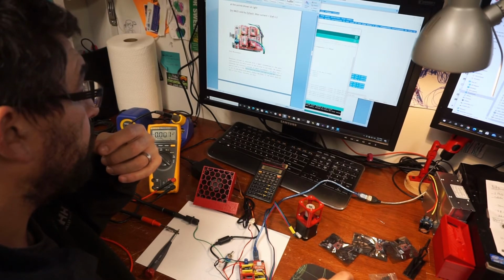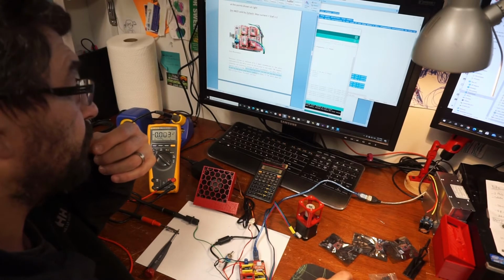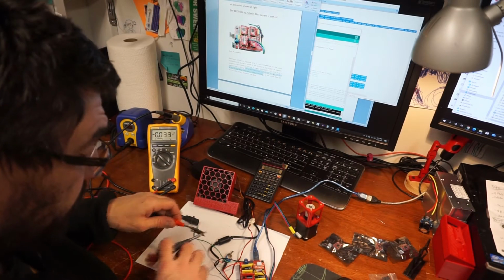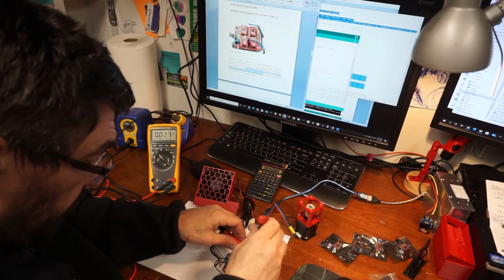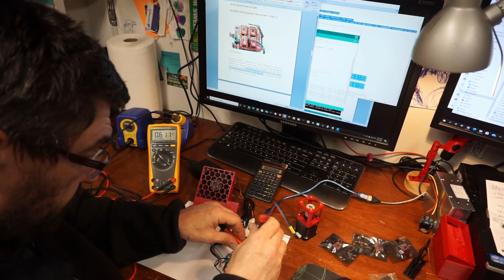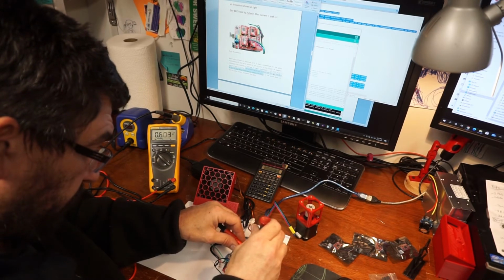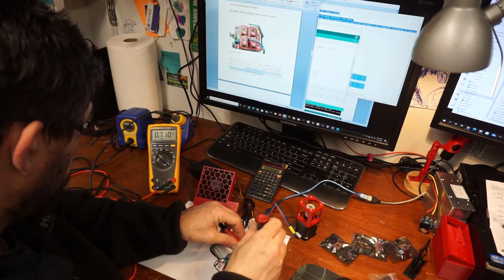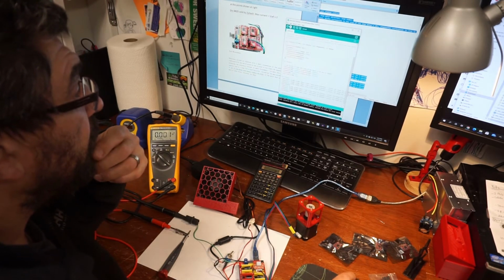For a starting point, you may set the max current to 1 amp. If the motor overheats, reduce VREF. So there's a thermal shut off on this. So I'm going to go ahead and put this up a little higher. I'm going to go to 0.7. Okay, upload it again.